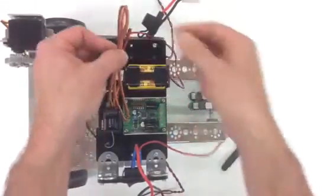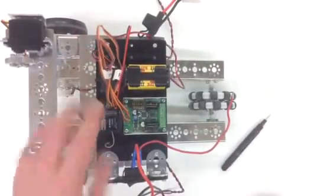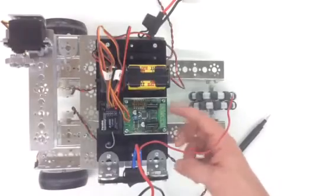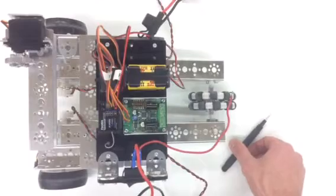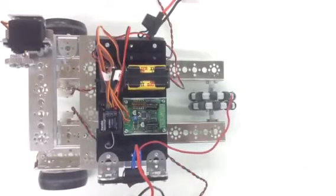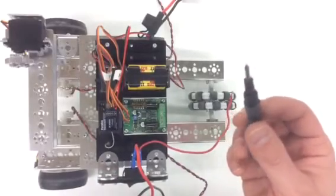Later I'm going to put a little twist tie around all of these so they're not in my way and look neat. Now I have all the wires connected to my receiver for right now. Next I want to plug in my DC motors into their spots on the side of the speed controller. To do that, you'll need the flathead screwdriver that comes in every kit — not a Phillips head, a flathead.